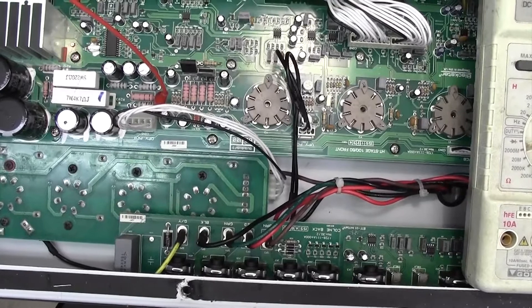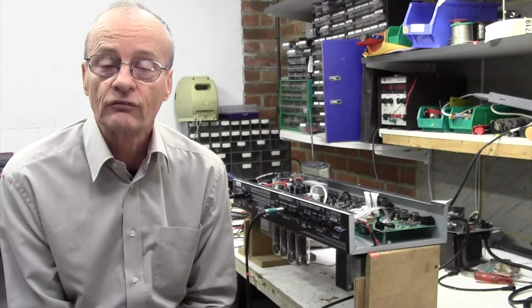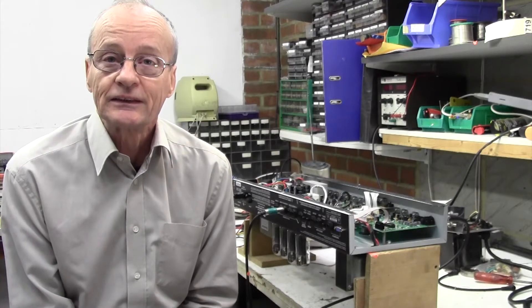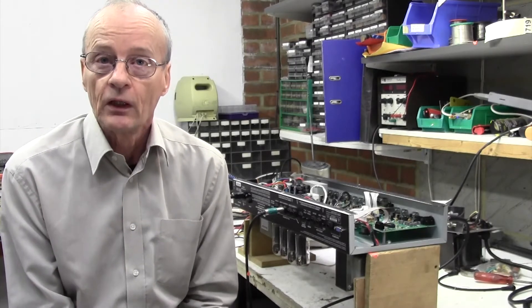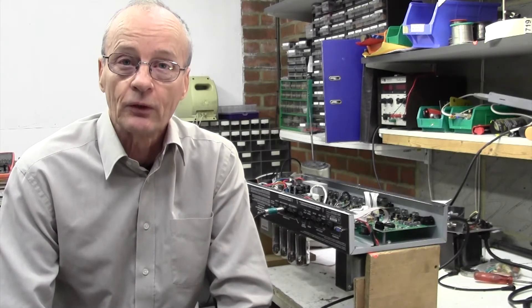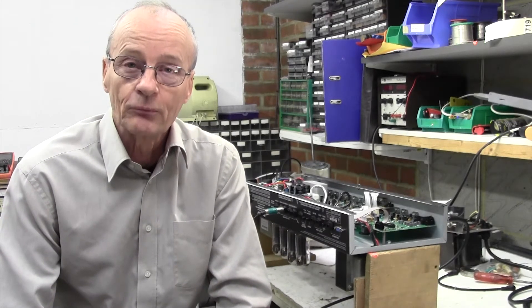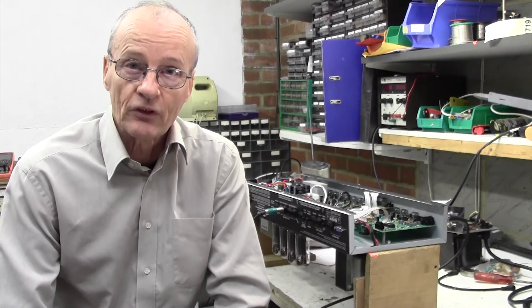And that's it — one Blackstar HT100 biased. I hope you enjoyed that and I think you'll agree that was a relatively simple procedure if you know where to look. Blackstar HT60 and Blackstar HT100 — you can bias them both using that method. I don't really like to work on these Blackstar amps because they're crawling with surface mount components and you can't really repair them at a component level. So when they fail it's a completely new board required. Blackstar are also very mean with their schematics — they're exceptionally hard to get hold of. So you can only do the most basic repairs to these amplifiers, but they're good amps.